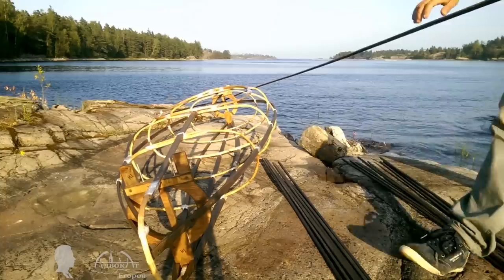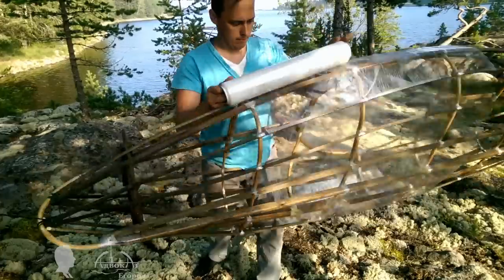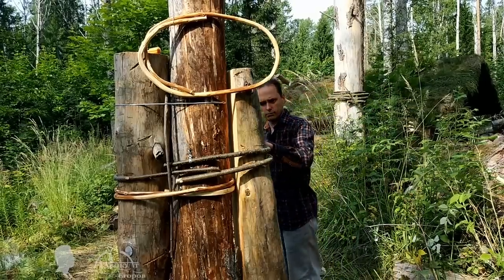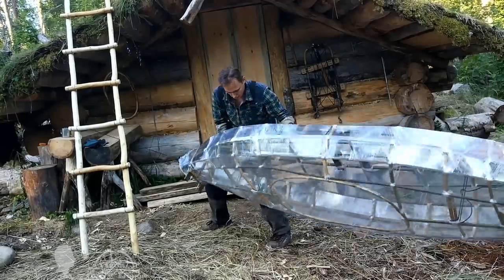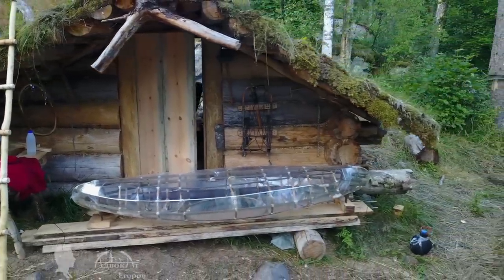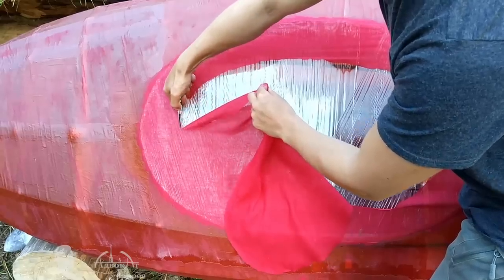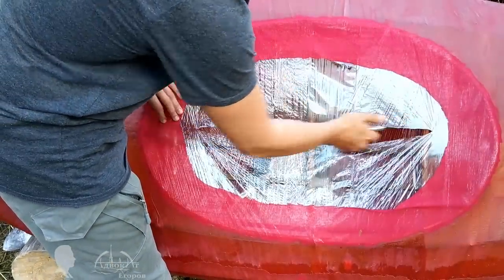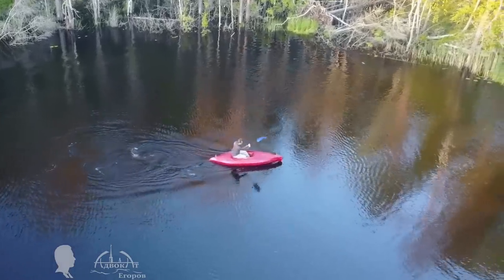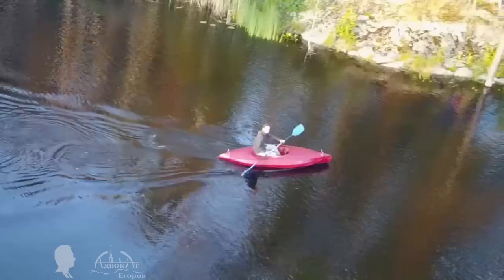You probably noticed that my new composite kayak has two latches, one on each end — it can be used as-is or included in a catamaran's frame. Last year I made a catamaran but didn't have much time to test it. Even though my plastic wrap kayak was fairly reliable, I decided to reinforce it with extra ribs and stringers and to reinforce the kayak's skin. I used synthetic fabric and polymer resin to mold a hard shell over its branch frame and plastic skin — now the kayak won't leak even if you hit an underwater rock. I've extensively tested this new model by running it over rocks and floating logs, and the new shell didn't even budge.